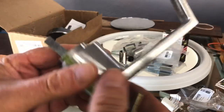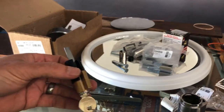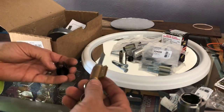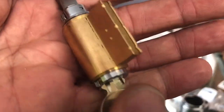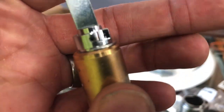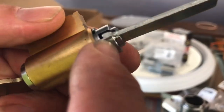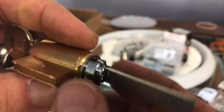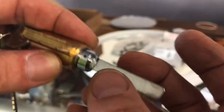Pull the key out and here's the problem scenario: you get a phone call saying 'the door guys just put a new push bar on my door and my master key won't fit it, I need a cylinder.' Look at this cylinder - number one, this is just a guide holder. Look at how this cylinder is designed: the tailpiece, where normally you'd have a screw cap or just a clip, does have a clip - but it has a roll pin driven completely through that holds it on. So you can't just take this and use it with a screw cap. You just take the clip off and follow it out like anything else, but you have to have a completely hollow plug follower.